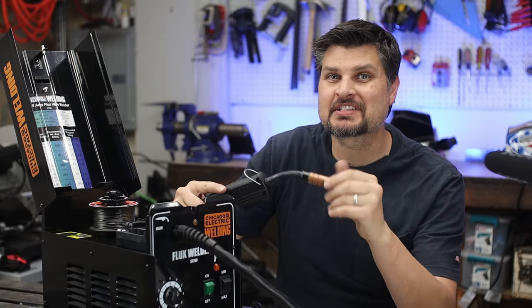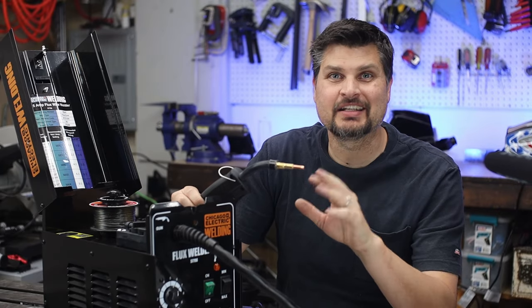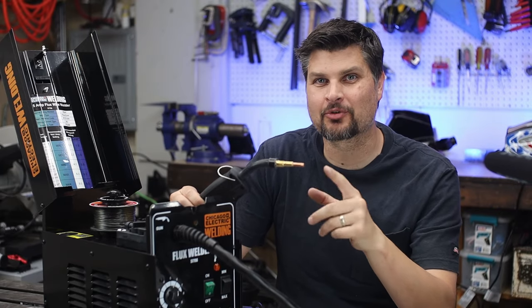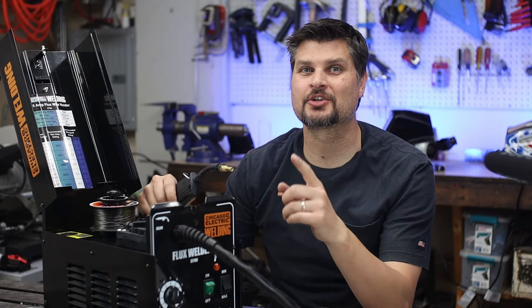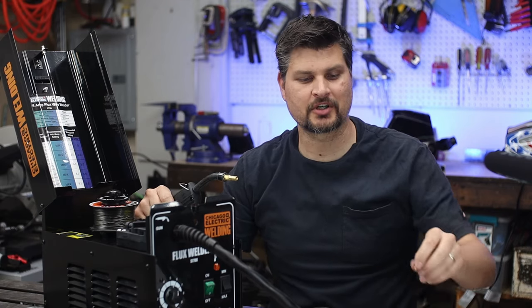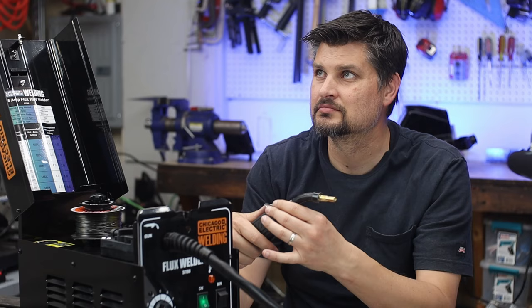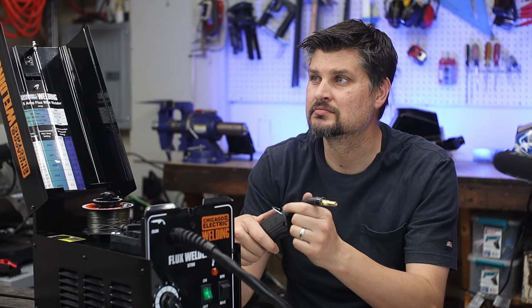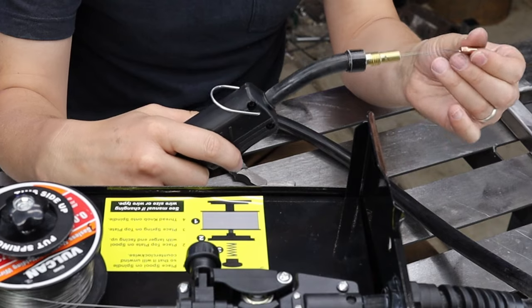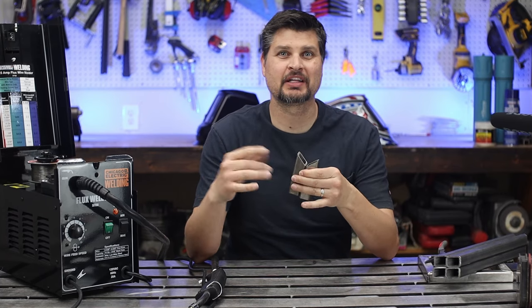We can now take off this nozzle and throw it away. I'm not kidding. Check out the video in the description for more on that. Take off the contact tip, turn the machine on, turn the wire speed up, and pull that trigger. Contact tip back on. Yeah, that took like 2 minutes and we're ready to weld.